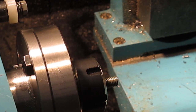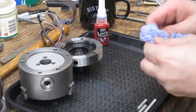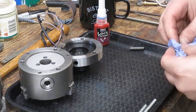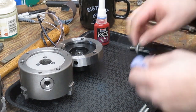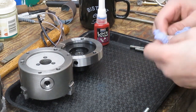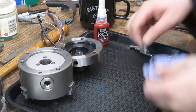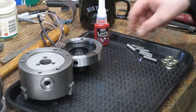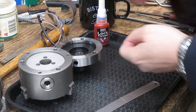That's the first one done. We'll get the other five done off camera and I'll bring you back to the bench. As you can see we've got all six machined. We'll give them a quick wipe down and then we'll get some threadlock on them and set them in their respective holes with a 17mm upstand.